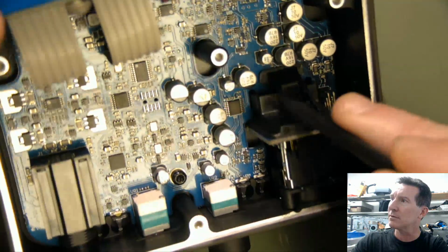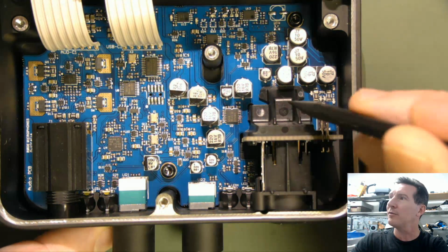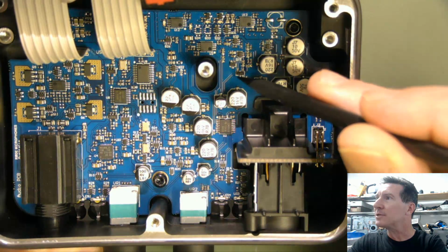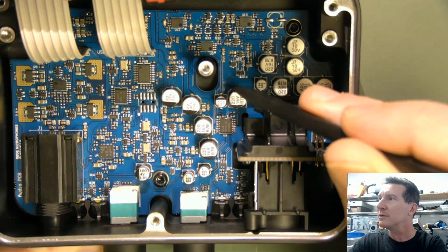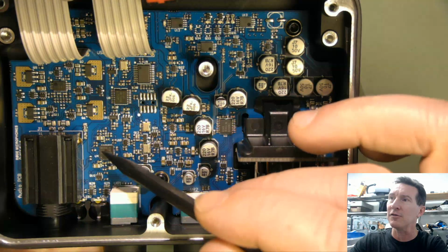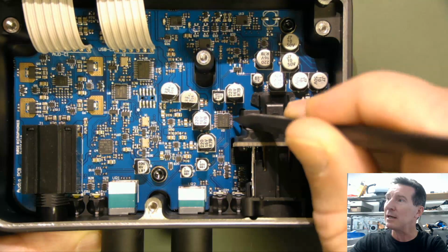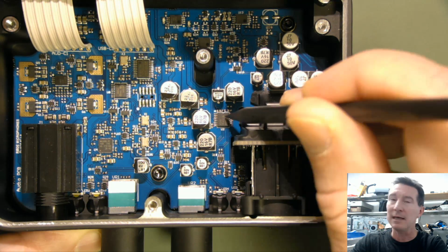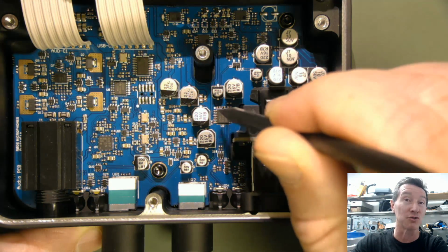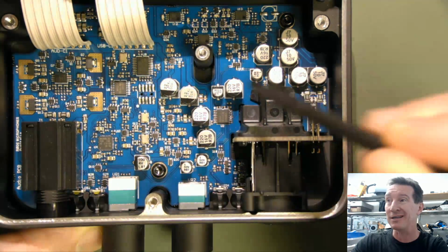They've got some sort of pins under here. So I think it comes into here, and then they've got a preamp on the input. I'm not sure. I didn't think it needed one; I thought this could handle the microphone directly. Anyway, it comes in and goes into the mux here, because you need this mux to be able to switch the microphone directly, analog, from the microphone input over to the headphone output, so you get zero latency.